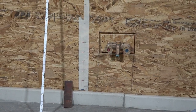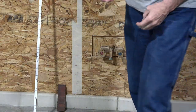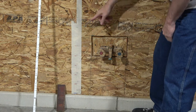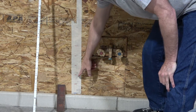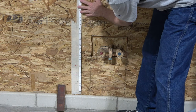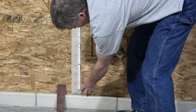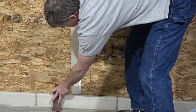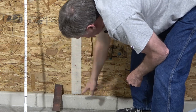In some rare lucky case your wall height would be a perfect multiple of the brick height and you wouldn't need any modifications. But here's what typically happens: I put the modular spacing rule up, marked all the lines down to the bottom, and there's a leftover amount of space that's not enough for the height of a full brick. In this case it's one and three-eighths inches left over, and you have to account for that somehow.